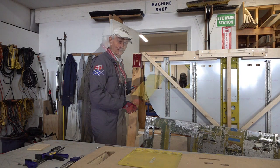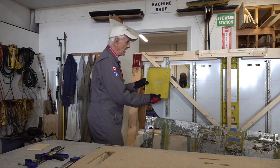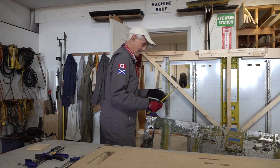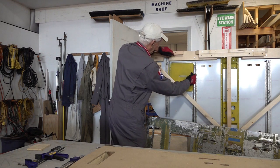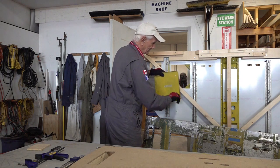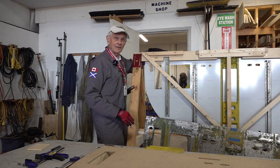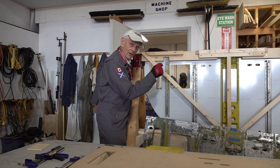into the bulkhead itself. This is an inspection door, which in the wartime days was used to open up and look into the bomb bay to see if there was a bomb still hung up, which would be rather unfortunate. But anyway, this bomb bay door now has to be attached here, like so, and then is fastened in place by means of two twist screws. So that's the next step to do after riveting these stiffeners in position.